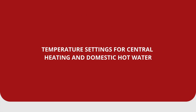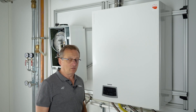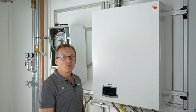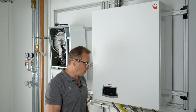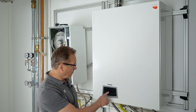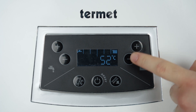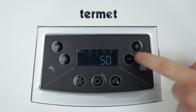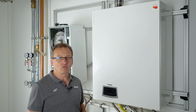If we want to change the central heating temperature setting, on the central heating side of the panel we must briefly press the plus or minus button — plus to increase the temperature, minus to decrease it. On the right field, the current temperature setting will then begin to flash. Using the plus and minus buttons, we can change the setting within the range of 40 to 80 degrees Celsius.